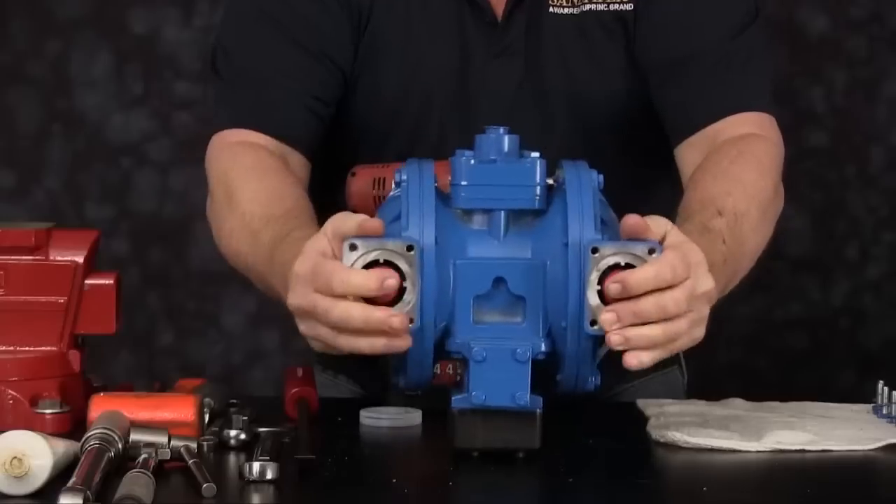As with the previous assembly, lubricate the inner seal and lubricate the outer radius. Install the diaphragm with the natural bulge out. Install the inner diaphragm plate with the radius towards the diaphragm. For easier installation, we want to invert the diaphragm. This assembly can easily be installed into the intermediate, catching the diaphragm shaft and spinning on in a right-hand clockwise position. Once snugged down to the shaft, we now need to align the diaphragms to the bolt holes in the intermediate. Never go backwards on this assembly — always tighten in a clockwise position and align the hole to the next hole ahead so the hole in the diaphragm lines up with the hole in the intermediate.